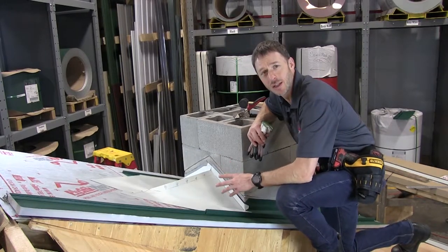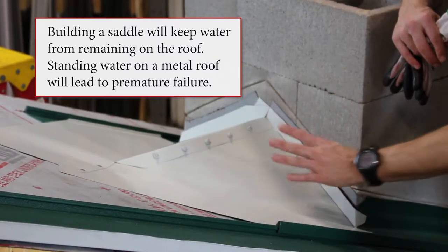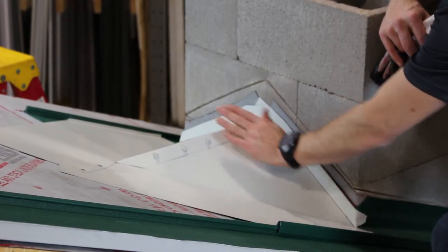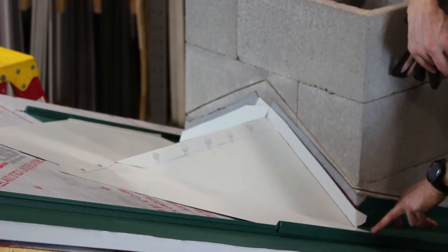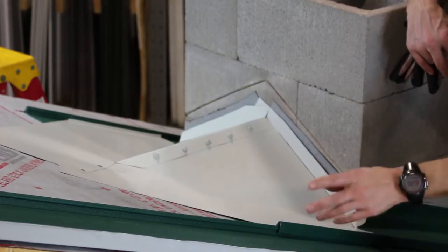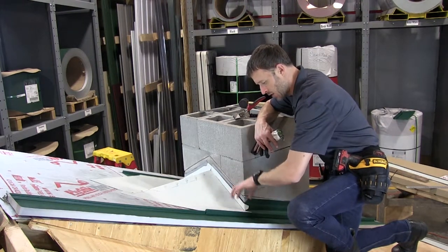What I've done here is I've taken two standard V-valleys and cut them. I've cut each piece so that they walk up the wall of the chimney, up and over the top of the saddle, and come up the roof deck. I've put a hem right here, folded it around the corner, and because this is a standing seam snap lock panel, on this side I've come up about 3/8 of an inch so that the next panel can come down and lock over this — we'll show you a close-up view of this.